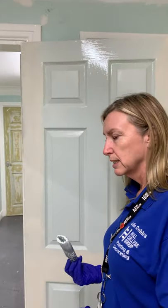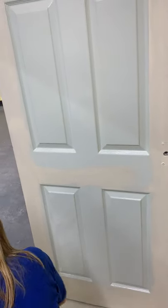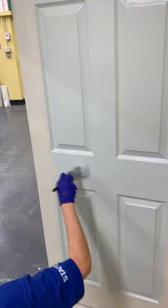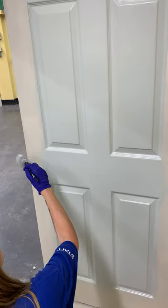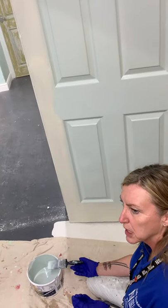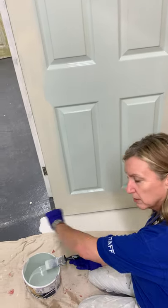Next is the lock rail. This is a pale green over cream, or pale blue — it's actually a china blue — and it's not going to cover in one coat. Don't try to put on enough to make it cover; two thin coats are better than one thick coat. When you go down to the bottom, you've got that paper there as protection. In people's houses the door is generally really tight to the carpet, so get a sliver of paper or masking tape — two-inch masking tape — underneath. You're not going to deliberately paint on that paper.